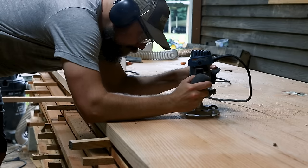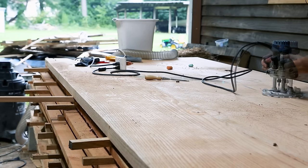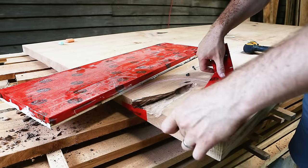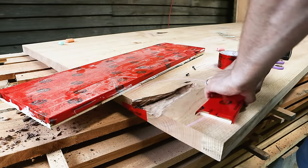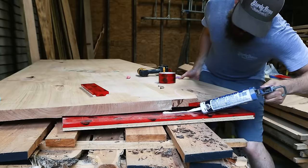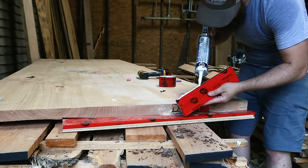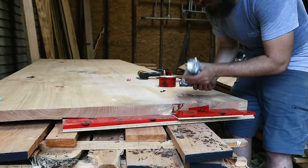There were a few really small knots I just cut out with a router — these also got the epoxy treatment. What you see me doing here is basically making a poor man's epoxy mold, or maybe a lazy man's epoxy mold. I didn't really need to wrap this entire thing in melamine, so instead I'm just using caulk to block off the parts where it might leak when I pour this little epoxy lake that dangles off the edge. And of course, right when I need it, my caulk gun's empty.